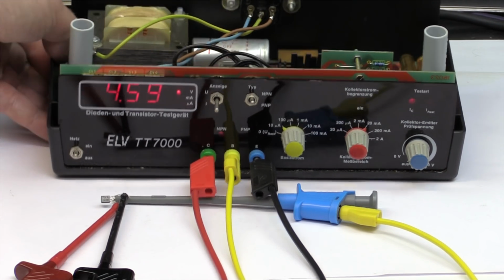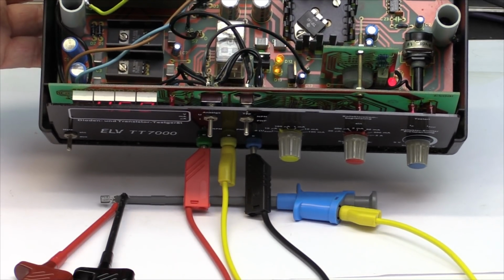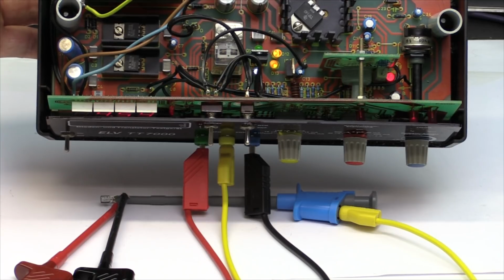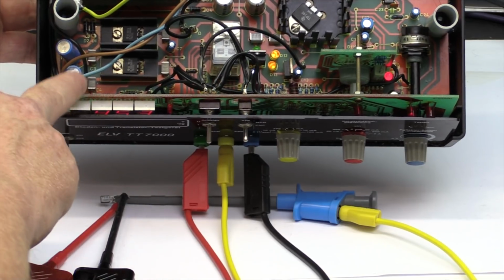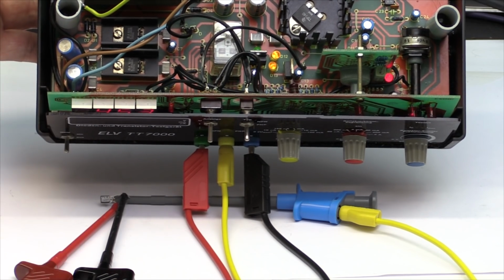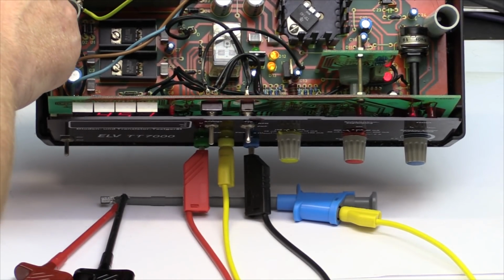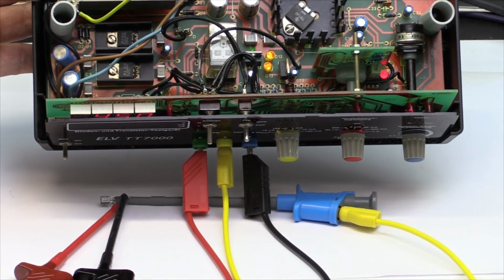And this thing is completely built up with discrete, well, not only discrete components, but as you can see, there are no custom-made components, all standard components. It's built up completely analog, except of course for the ICL7107 multimeter IC here on the secondary PCB. The only custom thing is the transformer with four different windings, but you can replace this or use two or three different transformers just to build this.